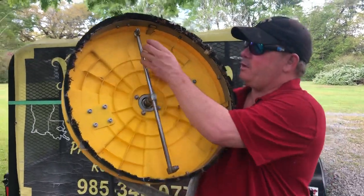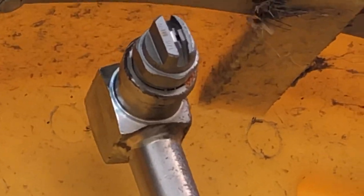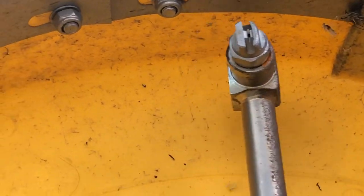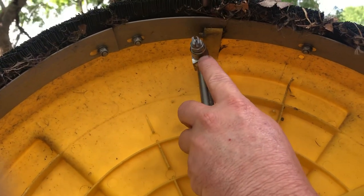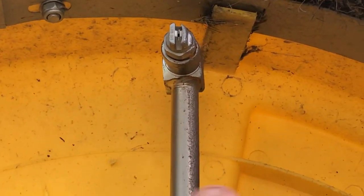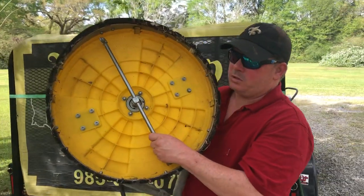Another quick expert tip: Jacob, come in tighter again. When lining up these tips — these are a little beat up so they need to be changed — you definitely want to line that spray tip up very evenly with the spray bar. That gives you optimal cleaning width on your surface cleaner. I've seen guys with tips turned maybe to one o'clock or seven o'clock instead of straight 12 to 6. Make sure they are straight up and down, 12 to 6, on both tips. Any sideways angle will cause you more hassle when cleaning.